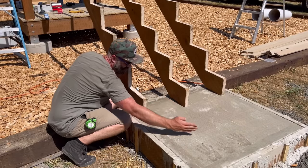Next it was time to put on the decorative side pieces — I'm sure they have a proper name, but I'm going to call them little decorative side pieces. I clamped them in place with Rockler clamps and drove screws from the outside right into the stringer. While not structurally necessary — the stairs would be plenty strong without them — they do add quite a bit of rigidity and make the stairs look a lot nicer and neater. With both sides done, the whole thing was starting to look like a real staircase.